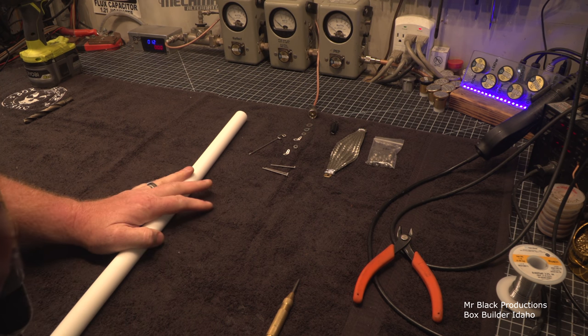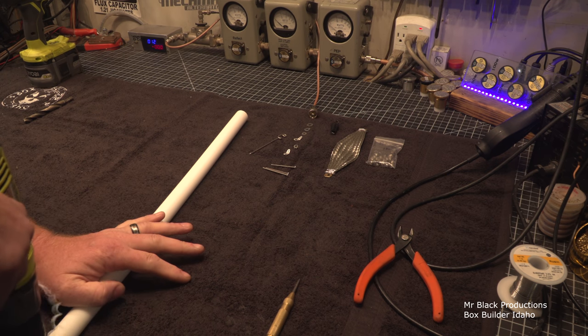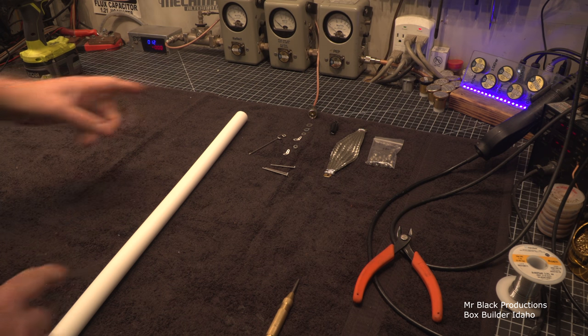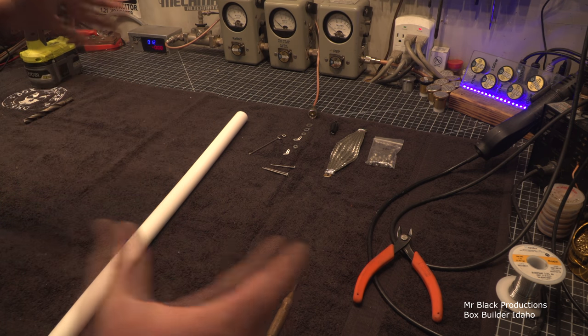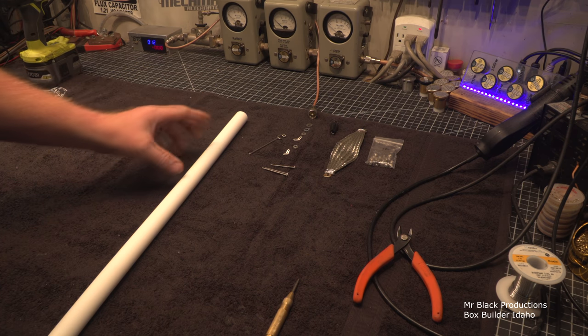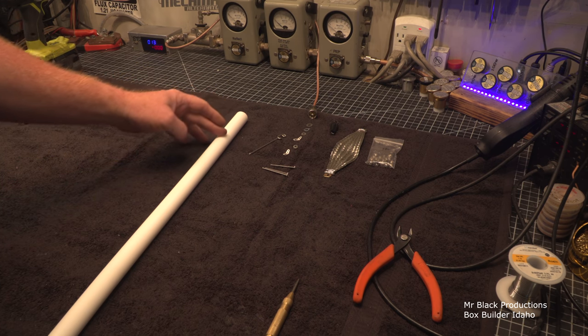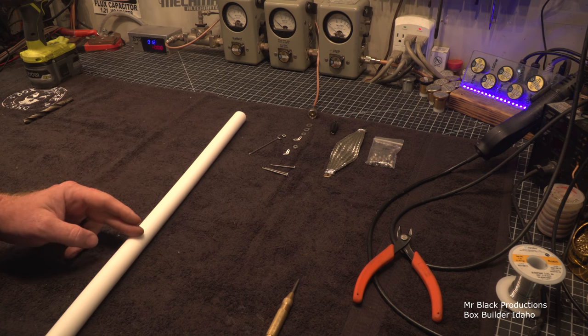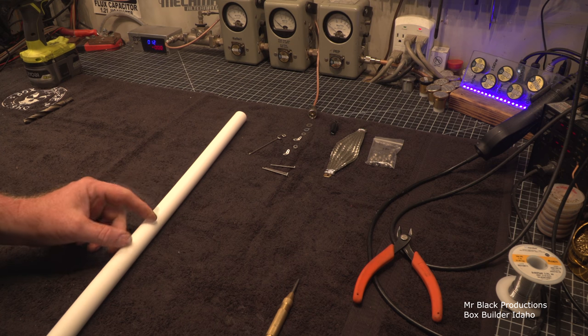Which leads to another phenomenon that happens in the electrical line world. In certain situations, you need to get out on that wire and go work on things. Now, I've been told about this, and I've seen guys do it on YouTube, where if the insulator chain is long enough, they'll literally start crawling. And you gotta remember, some of these insulators we're talking about are like 2.5, 3 feet across. They'll start crawling down that stack of insulators really slowly, and slowly bring themselves to the same electrical potential as the line. And once they're down on that line, they're no longer at ground potential, they're no longer the chance of being a conductor, and they're safe.